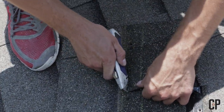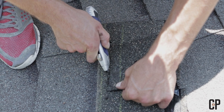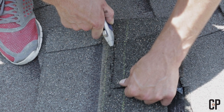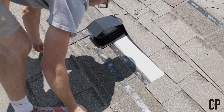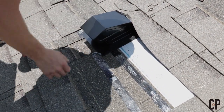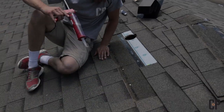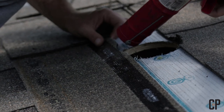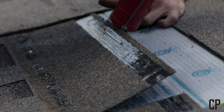When you're cutting the shingles like this, I'm using a hook blade on a utility knife. You need to be careful not to cut the shingles underneath — cut on a piece of cardboard or hold the shingles off the ones underneath so you're not cutting them. After you've cut it, on the bottom one you want to start to slide it underneath the vent. Before I put this first shingle in, I'm going to caulk the old nail holes as far underneath as I can to keep old moisture from leaking through the underlayment.